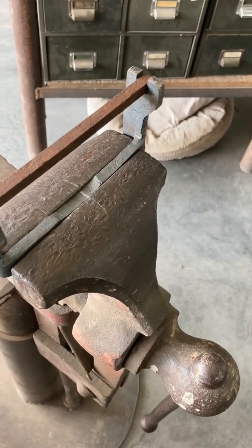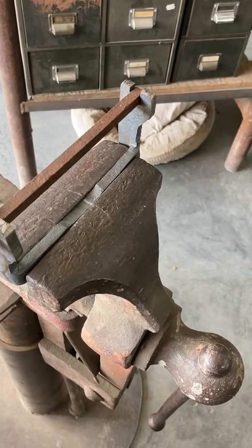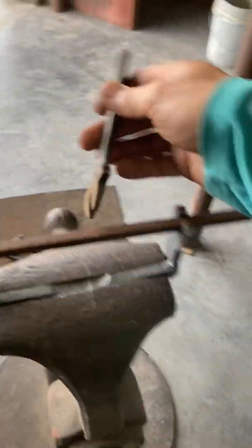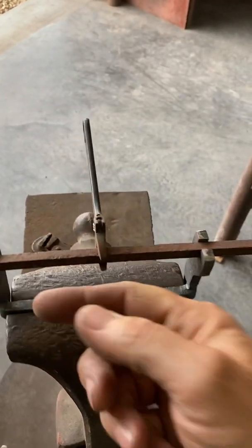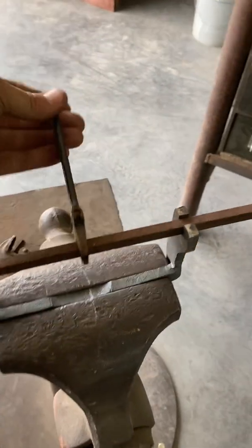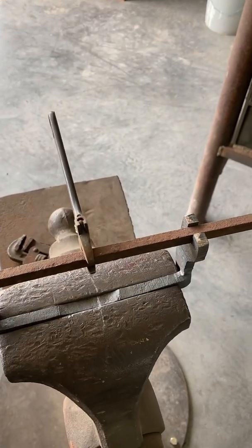When I'm doing it, I just stuck this piece of stock in the forge, heated it up, just the end of it, stuck it in there. For my video, since I only have one hand, I'm going to stick it in like that. I got me a little crescent wrench, stuck it here in the center of my deal and pulled this way. That turns this way — it turns both of them the same way, but it creates an opposing twist. I came and cut it right here in the center on my bandsaw. And that's how I created these two pieces.